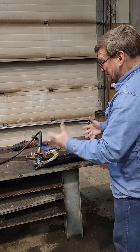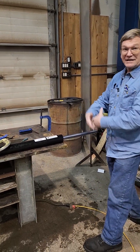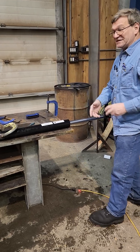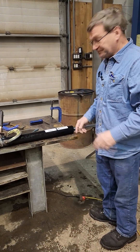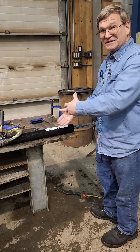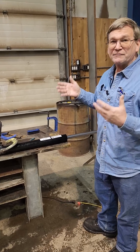The big thing this is about: even though this cylinder here has a lock ring in the front and can be taken apart, this was one where they welded the back, machined for the front, and put it together in pieces. You will find cylinders that are welded together — the head is welded in, they put the rod in, the piston, everything in there, and then the other end is welded — and you think it's not repairable.